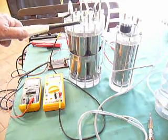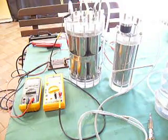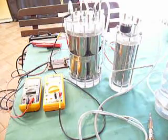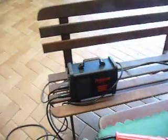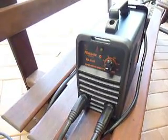I've been having trouble with the ATX power supply. It puts out 12 volts, 40 amps, but it's really not up to the deal — the voltage drops right off. Looking at new power supplies, anything up to about 50 or 60 amps at 13.6 volts is quite expensive. It's cheaper just to get a welder. So I bought a DC TIG stick welder for $208 — it's just a constant current source, and it's fabulous. We've tested it already and on the scope it puts out pure DC with no ripple.